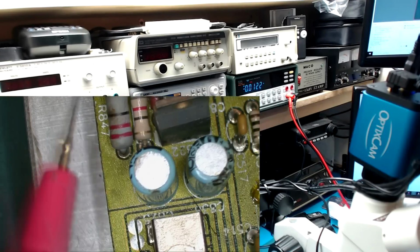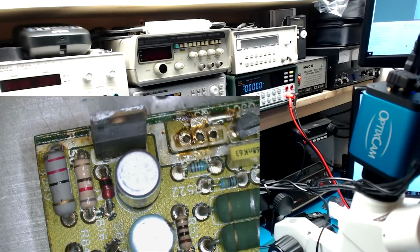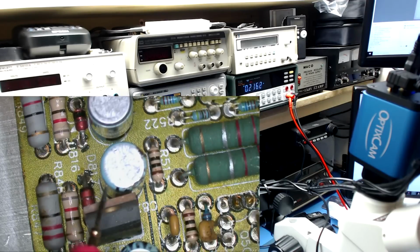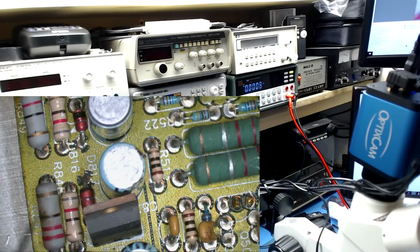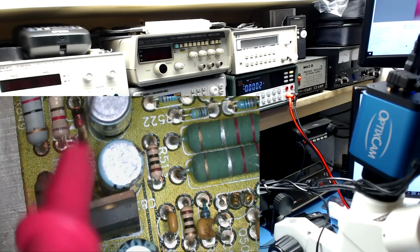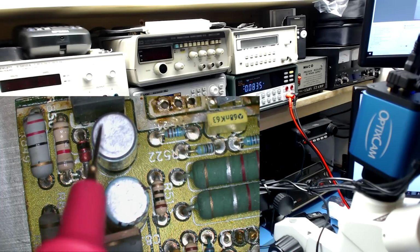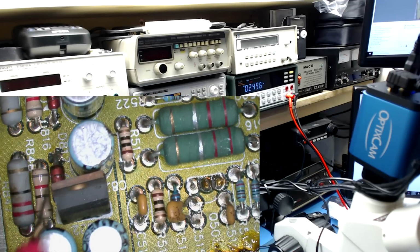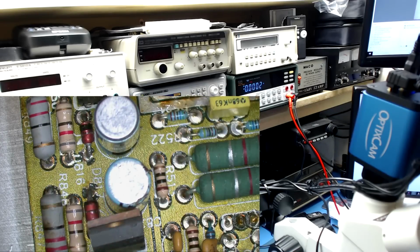My guess is it is going to be this suspected circuit here that we saw earlier with these two TIP41 parts. My guess is this is the positive and negative 15 volt rails, and these diodes are two Zener diodes that are probably 15 volts. So that discoloration on the board was probably a clear indicator that we have a shorted or non-functioning 15 volt rail for the op amps to work properly. So that is going to definitely lead us back to a power supply issue on the amplifier board.